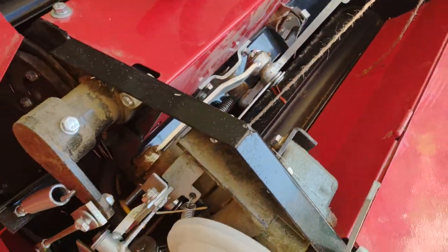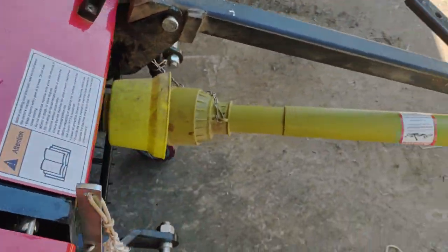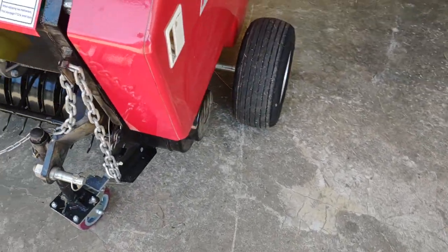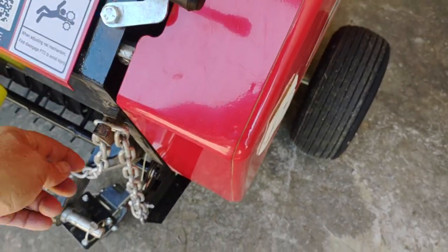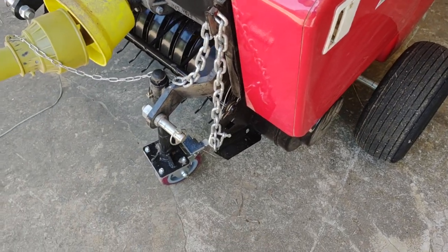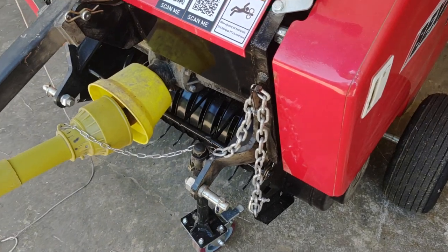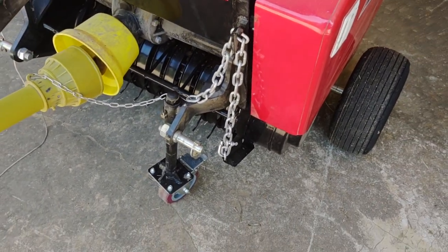You can kind of see we left a little piece of a bale in there — we'll get that out. This is just our first cutting and we're going to cut again. On this side of the baler, this is how you adjust your pickup head. You set this chain to however close you want that pickup head to go to the ground. It doesn't need to be closer than a couple of inches if you have rough terrain; with pretty smooth terrain you can get by with an inch.